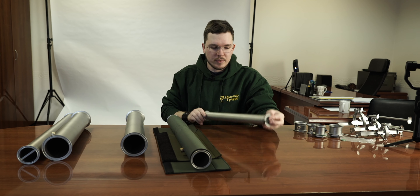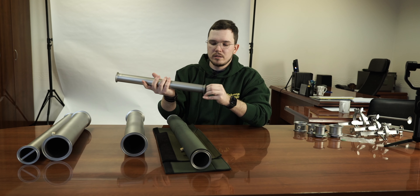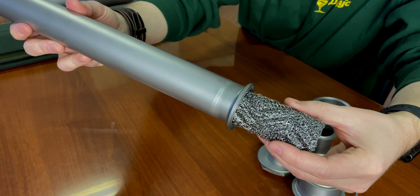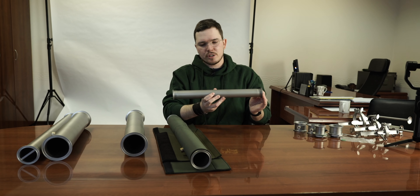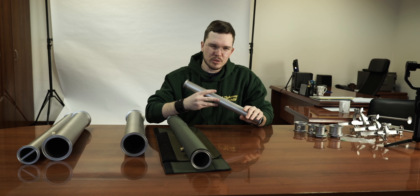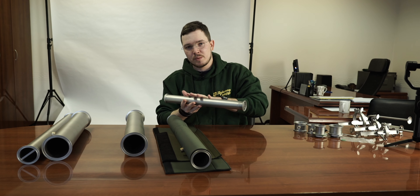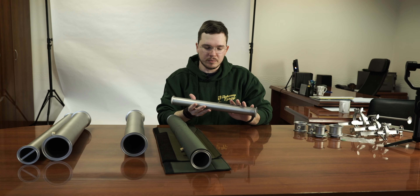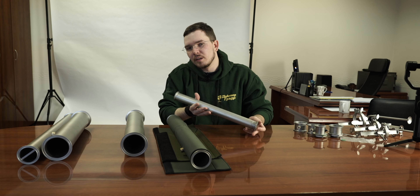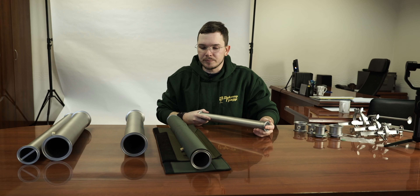As you can see, inside this extension we already have a mesh packing. The extension is filled from the bottom to the top. Each of them we usually fill with this packing, but we can change it to SPP or other packing material if you need — for example, copper SPP or stainless steel SPP, in smaller or bigger sizes, depending on the still you run.